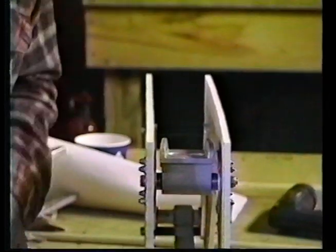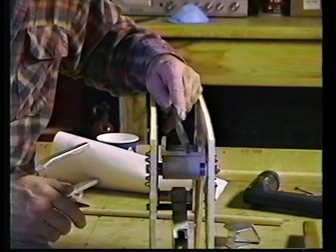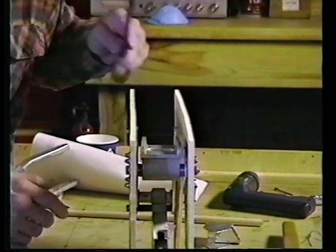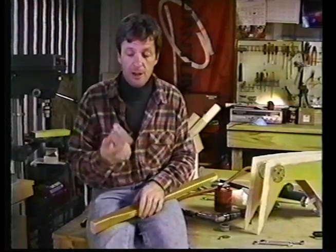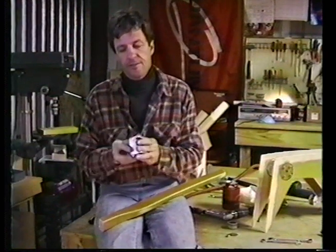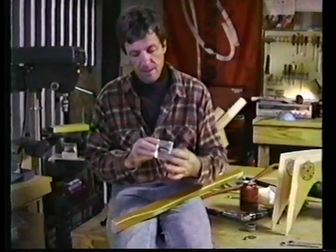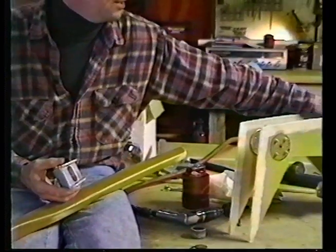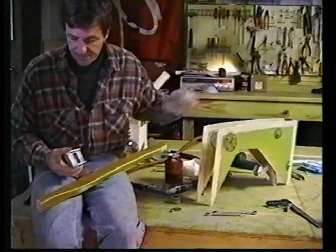Where I would file the casting would be front on this side, which, if I'm right side up, would be the right side, and rear left. So I'm going to file here, and I'll be back with you after I perform those tasks. We took this off. File, if it's right side up, would be front, the top right, and the bottom left. We put it back together again, checked it, and made sure that we could recenter the strut at the back. That's absolutely paramount. Very, very important.